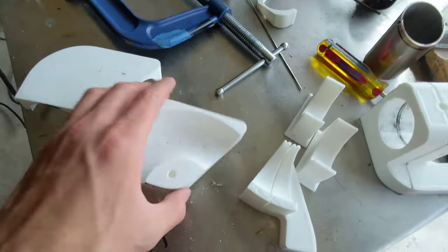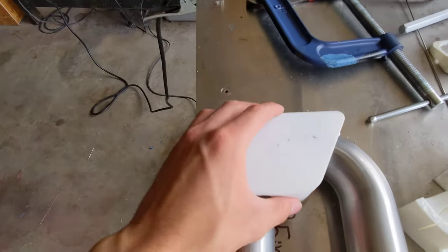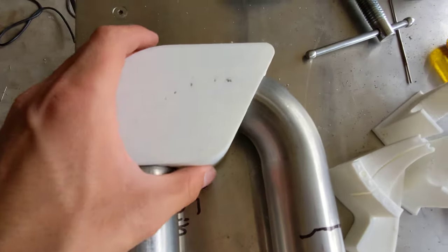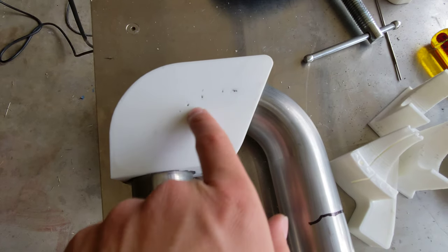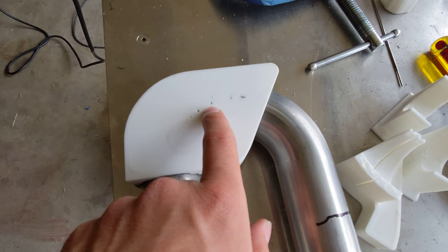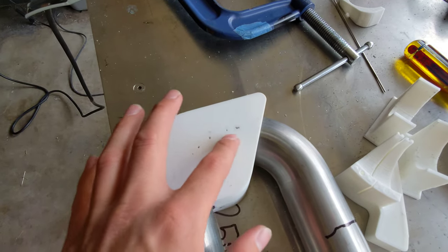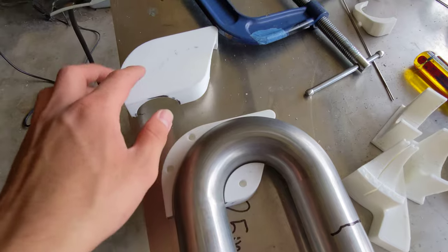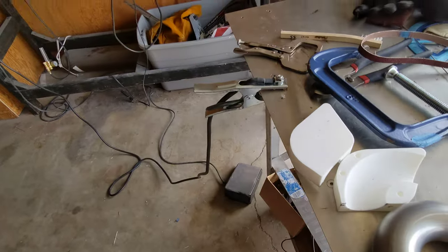This piece is for the angles. These are just pre-bent 180 bends. Basically this just sits in here, and this piece has some pegs — it goes in here and I can square it up with a T. Each one of these holes represents whatever angle the CAD spits out. Like this one was 82.99 degrees and this one was 79.8. So it just helps me get a general angle cut, because the level of tolerance the CAD spits out is not what I'm able to cut. I just need to get it close enough and then figure it out at the end.